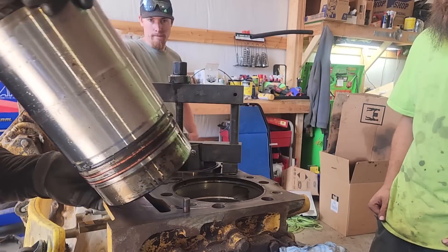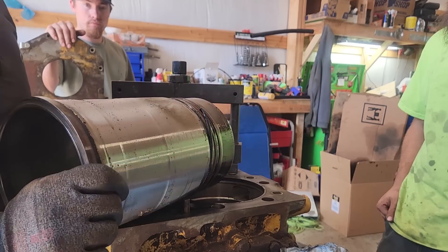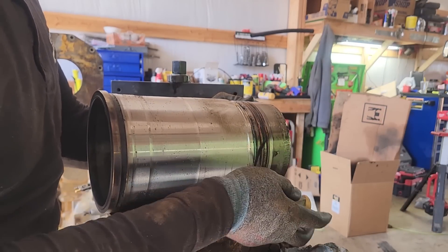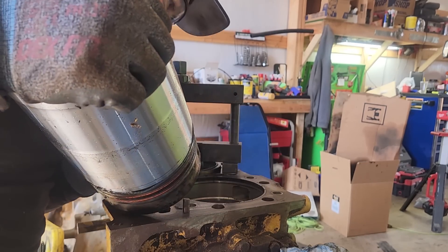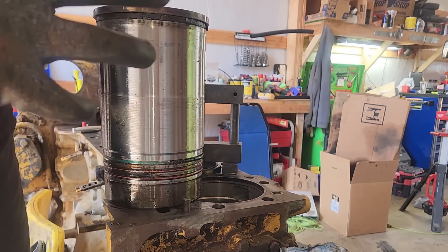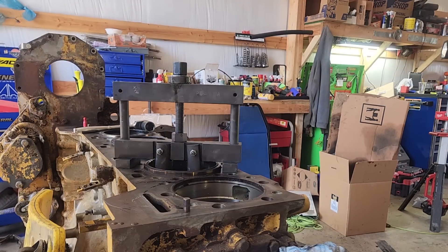The liner's outside diameter is the same as on a C15 or 3406E, but the inner diameter — the bore — is different on the C18. Look at how thin these seals are; they're basically rubber bands. That's because the block is essentially the same from a C15 to a C18, so you can't have full-size o-rings since the liner itself is so much thinner on a C18. And yes, the thinner liner is what makes more power — which is kind of crazy if you think about it.